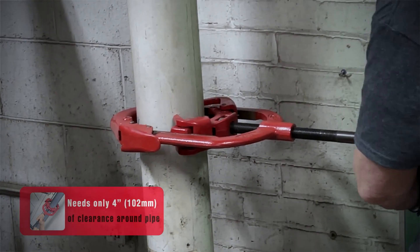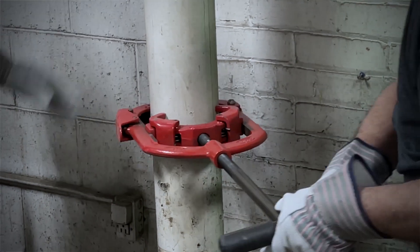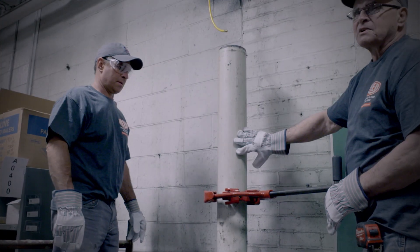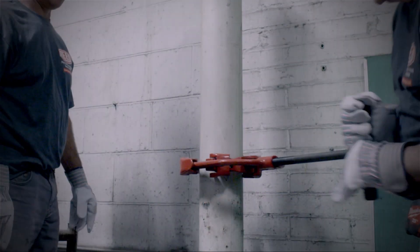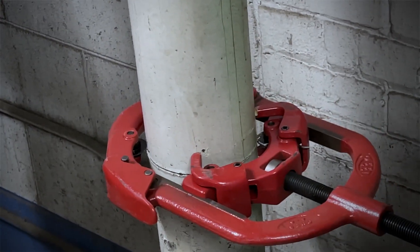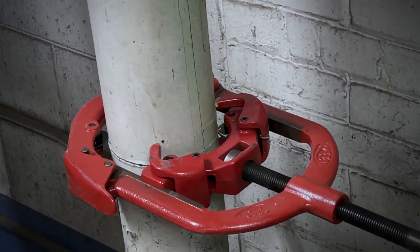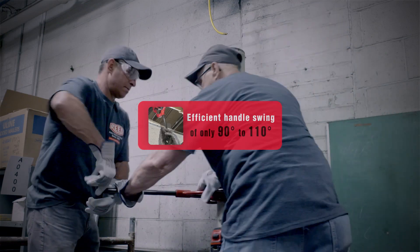Make your first initial cut to mark it. You got to go both ways on it with one turn. The first time there might be paint or something on the pipe, so it might be irregular. That's why you do a light touch-up to it. If it feels hard, you could go a couple times like that before you twist it. Don't go a whole wide — you don't have to force the handle because it doesn't do anything but put too much pressure on the cutters.